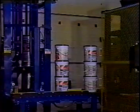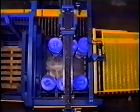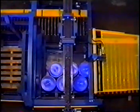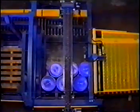Pasco brings over 20 years of experience to this pail palletizer. It is one of a family of three: series 4200, 4300, and 4400. This particular machine is a series 4300, which is a high speed single stacking pail machine capable of handling two, three and a half, and five gallon pails at 20 containers per minute. The series 4400 is capable of handling anywhere between a two gallon through a 55 gallon container.